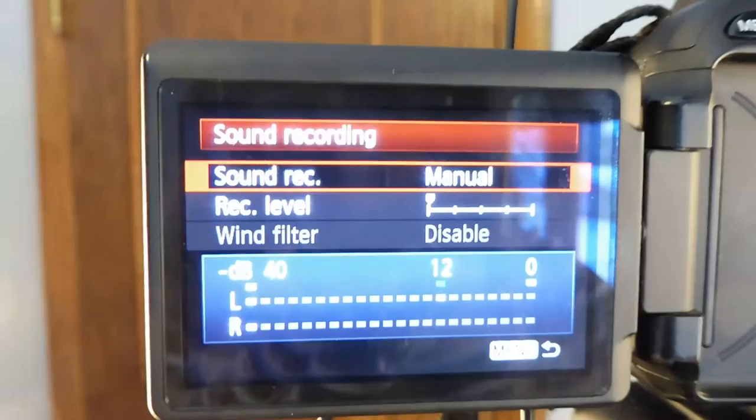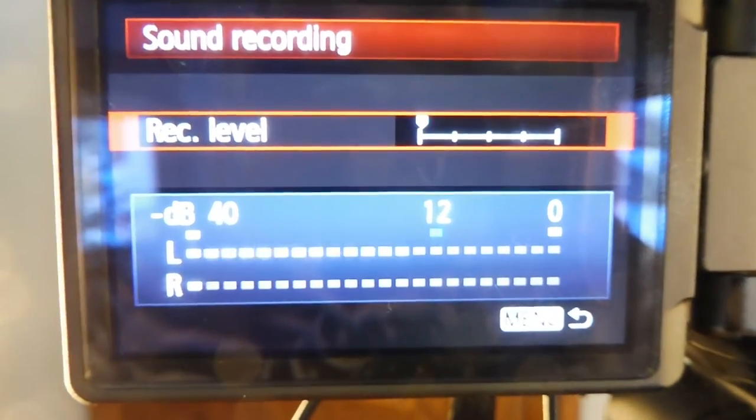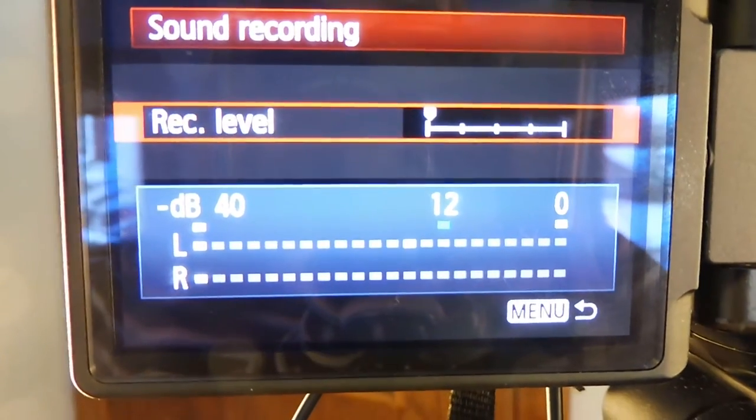Now here's where it gets just a tad complicated, but don't worry — you can do it. You're going to have to go into your camera's audio settings and change the audio recording to manual, and turn down every single setting to almost zero except for gain, which will be one tick above zero. The reason we have to do this is because you don't want your camera's internal microphone overriding the external microphone, which has much nicer sound quality. Once set up, those settings will stay in your camera even when you turn it off and on, which makes it nice and simple for future recordings. But be aware — if you ever record without the mic attached, there's going to be no audio; it'll be so quiet you can't hear it.